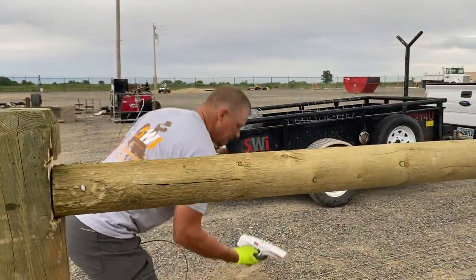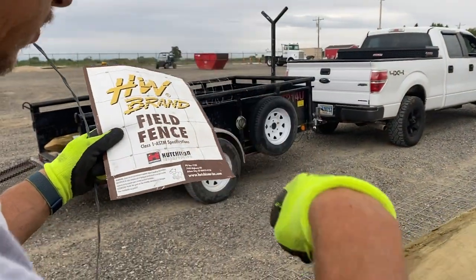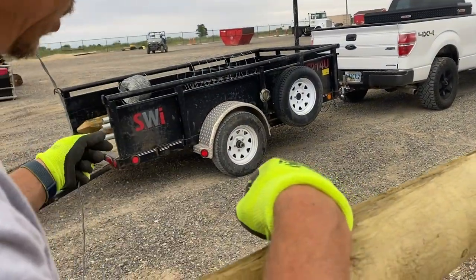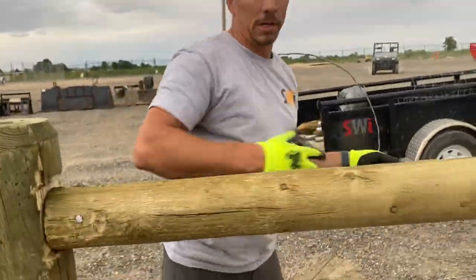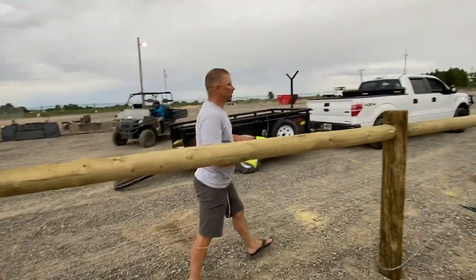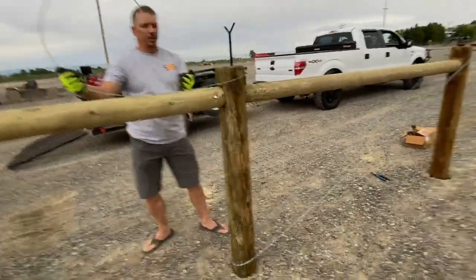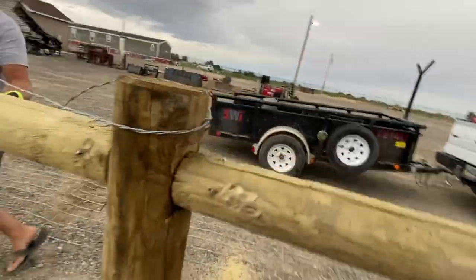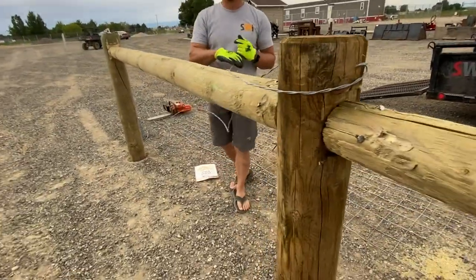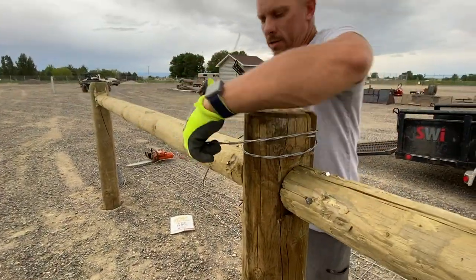Here's what we're using for the field ties: Class 1, ASTM specifications. It's got a top and bottom wire, 9-gauge. It's nothing against HCW—it's just that all low-carbon wire is trash. High-tensile is really all there is that's good. That was great back when they were settling the plains, but that's not where we're at today.